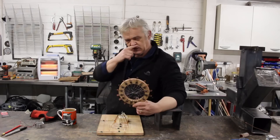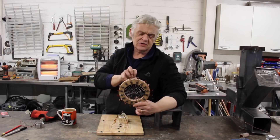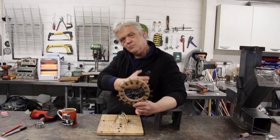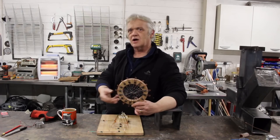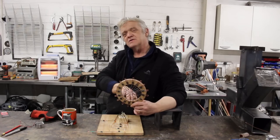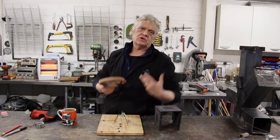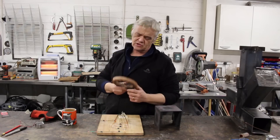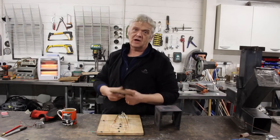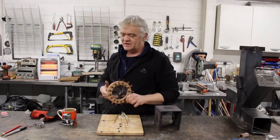This one is a thermally activated MIM diode, and it uses the difference in heat to move electrons past that diode so they can't come back. Because they can't come back, they can only go one route around the circuit, and that's to generate electricity. So this is a thermal generator based on a diode, using heat difference — and that really matters.